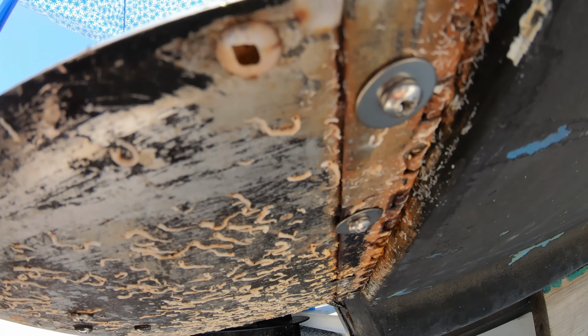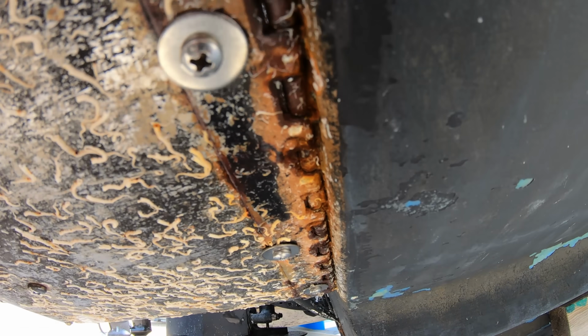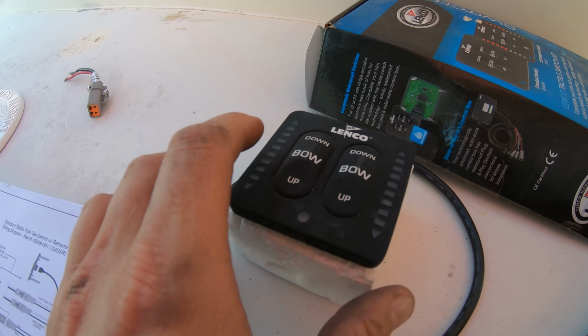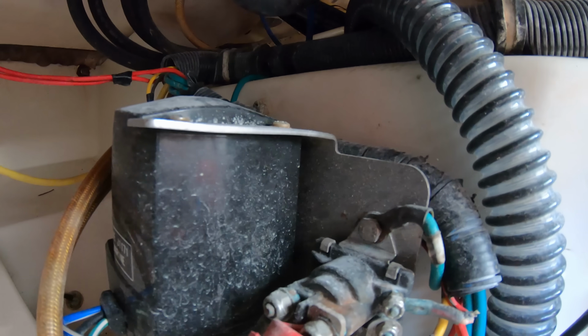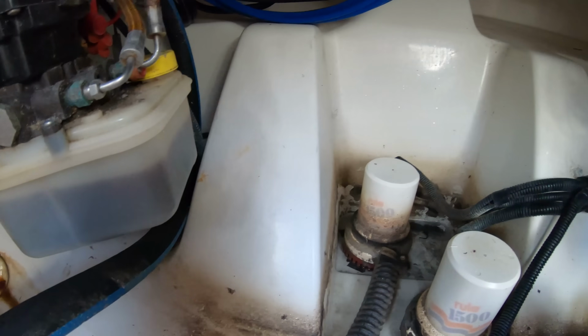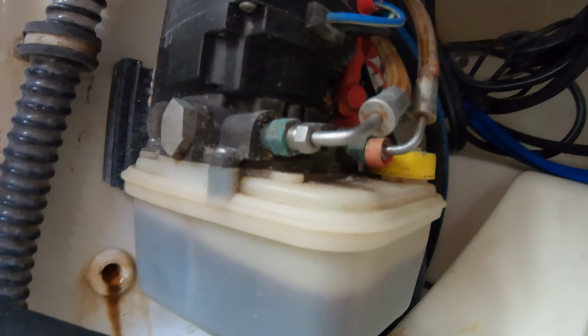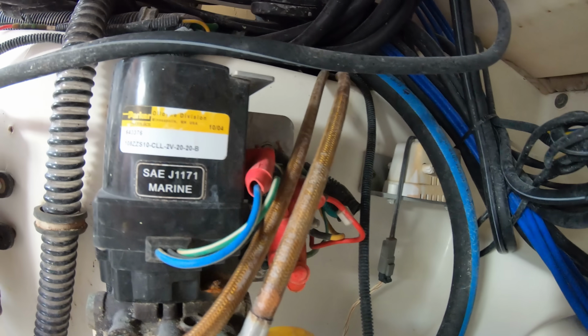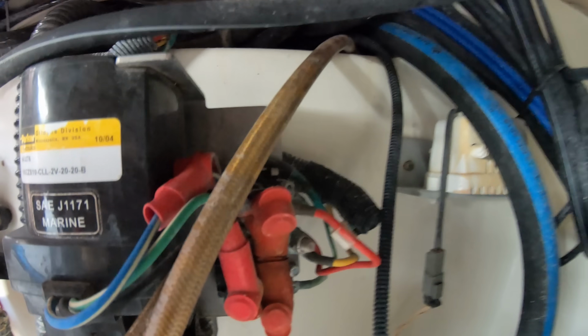We also see the actuators lock up, the control pad stop working, the indicator lights stop working on the control pad. Then on the hydraulic systems, usually a relay fails from water and moisture and corrosion. Then if one of the actuators seals leak, and water is sucked into the system, then the hydraulic pump itself or the electric motor will rust and eventually stop working.